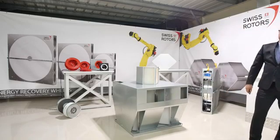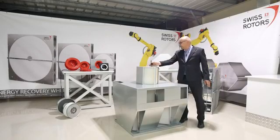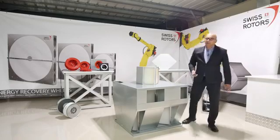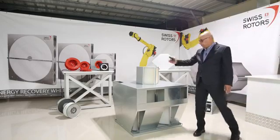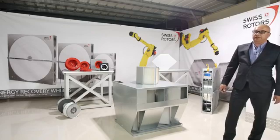The drawings and sketches show how the air goes through it. The principle of counter flow heat exchangers is the same everywhere — going in one direction through the counter flow and then going up. The exhaust goes a different way: parallel counter flow and then going out. Thanks to this, you don't need to think about how to install single counter flow plate heat exchangers, because we have done it for you in a common casing.